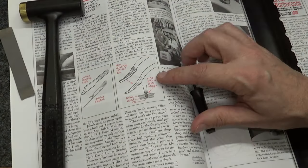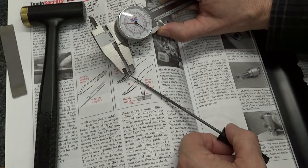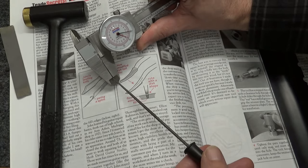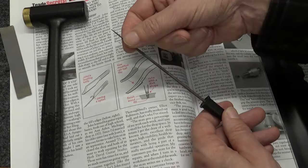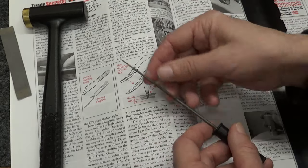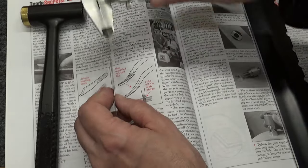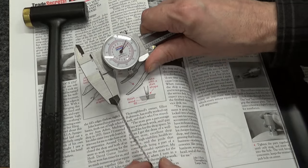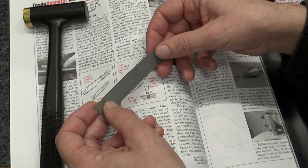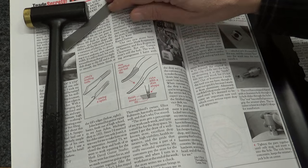I found this article in the Trade Secrets Volume 2. But you can see it still only works for bigger cracks than the one I'm working on now. My rat tail file is 30 thousandths at the very least and it's tapered — he's talking about taking the taper off, grinding off some of the teeth on the sides. Still the shark sandpaper stuff is 13 to 15 thousandths. This is still the thinnest for a crack this small. It's a challenge when you're working with a small crack.